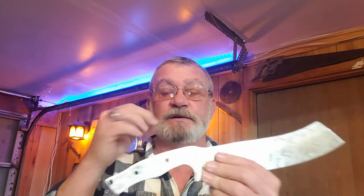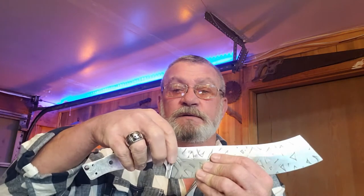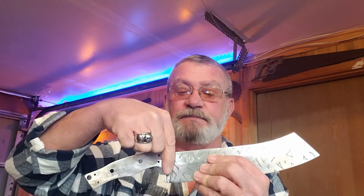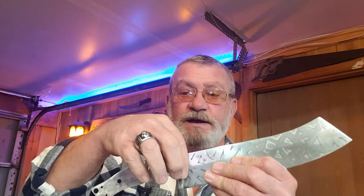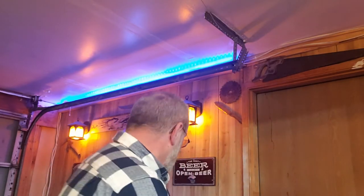This brass that goes up here is going to pretty well have to be the front part of it anyway, where it's going to slope down and meet the blade right here. It has to be finished before I can put it on the knife, because I can't be grinding right there on the grinder or I'll scar the blade up now that it's finished. So we're going to get to work on that and get all our pieces cut. Start shaping, getting our micarta scale liners cut, and start trying to get them into place, and see if we can't get this handle finished up.